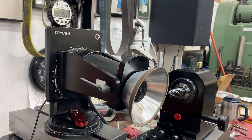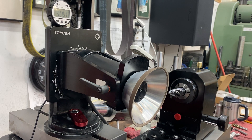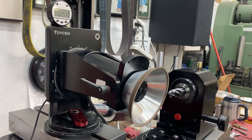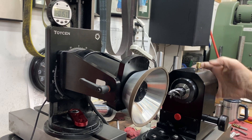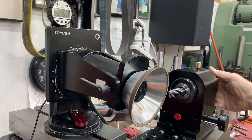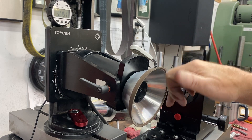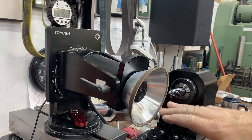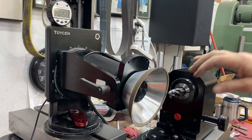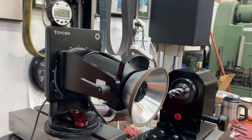When you want to set up for the next flute, loosen up the tool — don't change the length at all — and just set up again with the other two flutes, set them up square, and repeat the process, rotating it over 90 degrees. In this way, you've located the axis of the two flutes independently — the horizontal flute and then the vertical flute — because the way these are pitched a little advanced, you've got to kind of re-square the tool to the machine before you grind that other radius.